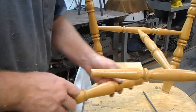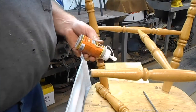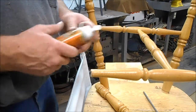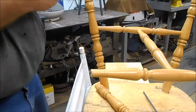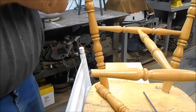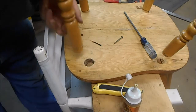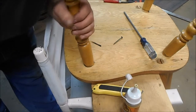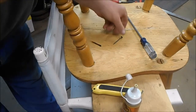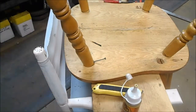We're going to get us some glue — some Gorilla Glue. A little Gorilla Glue for a little hole of this chair — I hope. The guy that owns this chair, he's as big as a Gorilla, so we're going to make sure it holds in. We put a little Gorilla Glue on there. I want to try to get that hole lined back up where it was so when I put that screw back in there, I want that screw to go back in the same hole. We'll get that screw tightened back up in there.